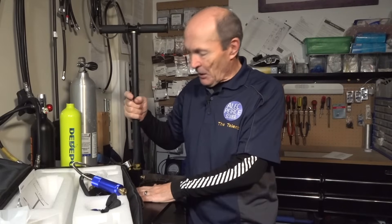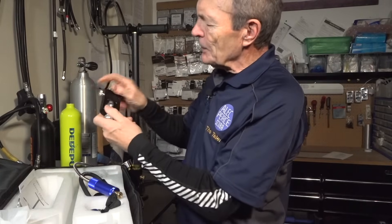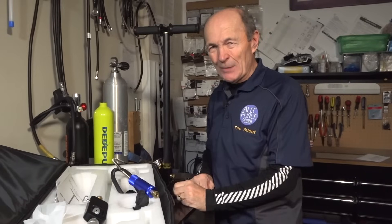If you have a standard scuba tank and you're trying to save a bit of money, or maybe you're at a dive site with no compressor nearby and no dive store really nearby, you want to go for a couple of dives — you dive with your tank and then fill it in between dives. There's a special fitting, like a yoke that goes under your scuba tank with a bleed valve, and this fits into there. So yes, you can fill your scuba tank with a hand pump.